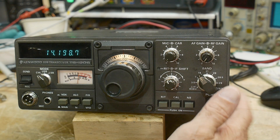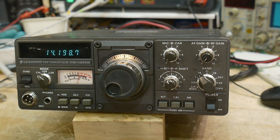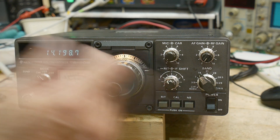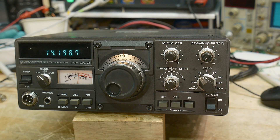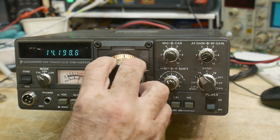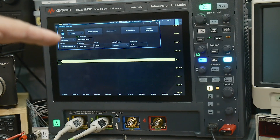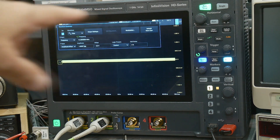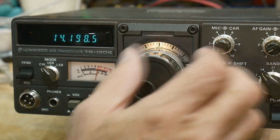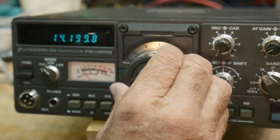I haven't played with this radio for a week, so I decided to get back onto it. I plugged it in and the display didn't come on, but after about five minutes of warming up everything seems to work — something intermittent, it needs to warm up. Now I can get everything again, and strangely enough at 14.2 I can now receive. I'm using my oscilloscope's wave generator at 14.2, and at 14.985 if I go to 14.2 it nulls out, so that seems to be working.